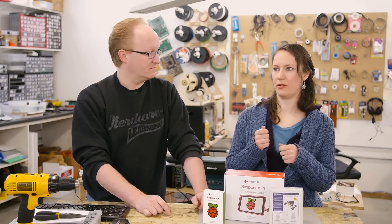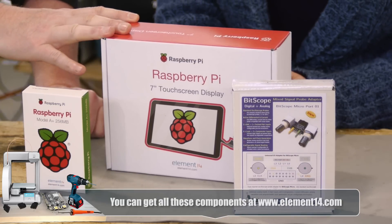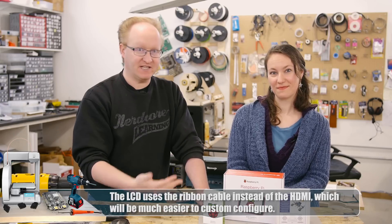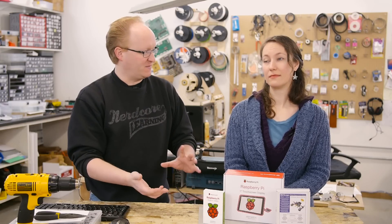Normally the Bitscope would have to be plugged into another monitor or computer — like a laptop — and then have the test leads external to that. You'd have your computer, then the Bitscope which is basically just a PCB, and then you'd have a BNC connector to connect to standard probes. So we're going to put that all into one module. We also have this new seven-inch touchscreen capacitive Raspberry Pi display. It's a really nice quality screen; it attaches to the Raspberry Pi using a ribbon cable, so I think we can use this as the front bezel of the unit. Having the touchscreen will be a nice added feature for a self-contained unit.